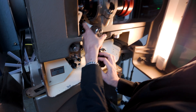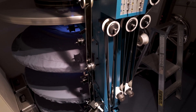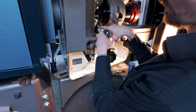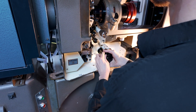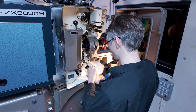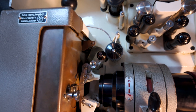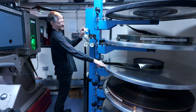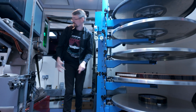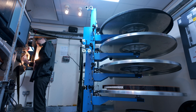Then we set our loop sizes — all projectors need a loop. In order for the film to be held stationary while the light is passing through it, there needs to be a loop at the top and a loop at the bottom. You don't want those loops too big, because if the loop contacts the film it can scratch it, and if a loop's too big it'll flap about, rattle, and cause the projector to run quite noisy. There's a little red mark indicating where the height of your loop should roughly be. Then we turn the take-up deck on so that, under tension, when we turn the projector over it will take the film with it onto the next bit.